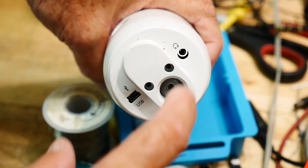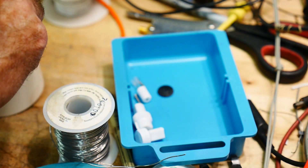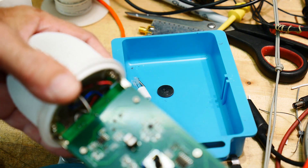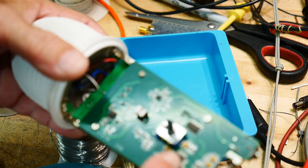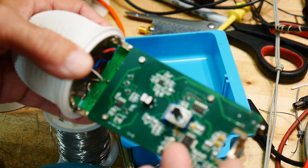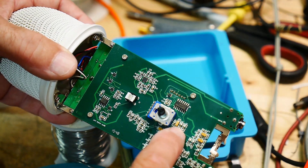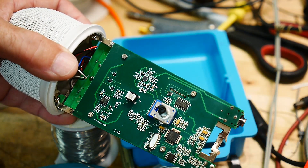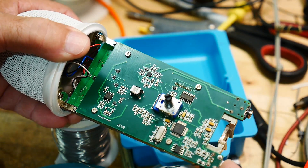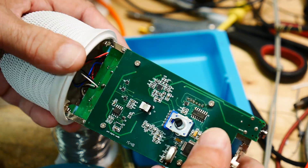There's a USB connection but there's also a headphone connection on the back. Analog is brought out to the headphone connector. I think having this chip dead means the signal isn't getting routed over there, because I think you can control the volume or routing digitally. But what I do know is there is an active analog signal. So I'm going to cut the two traces that go to the headphone jack and route the known-good analog signals to the headphone jack, turning this thing into an analog-only microphone. It still requires power, which the USB provides, because there are amplifiers and transistors over here.